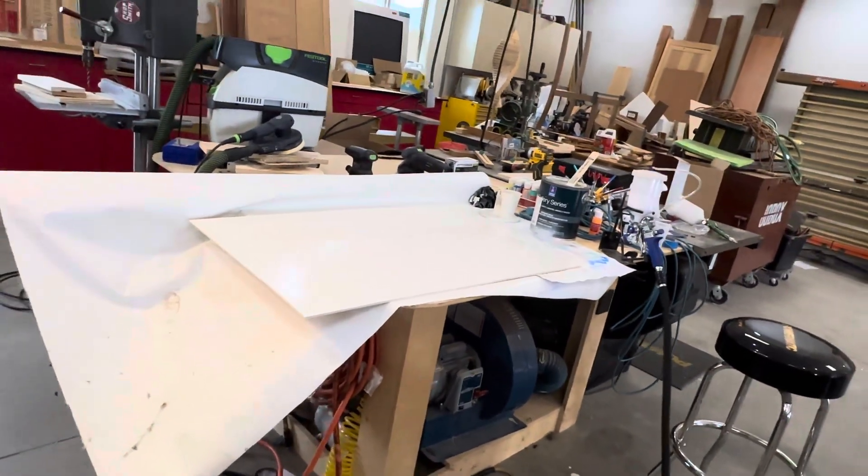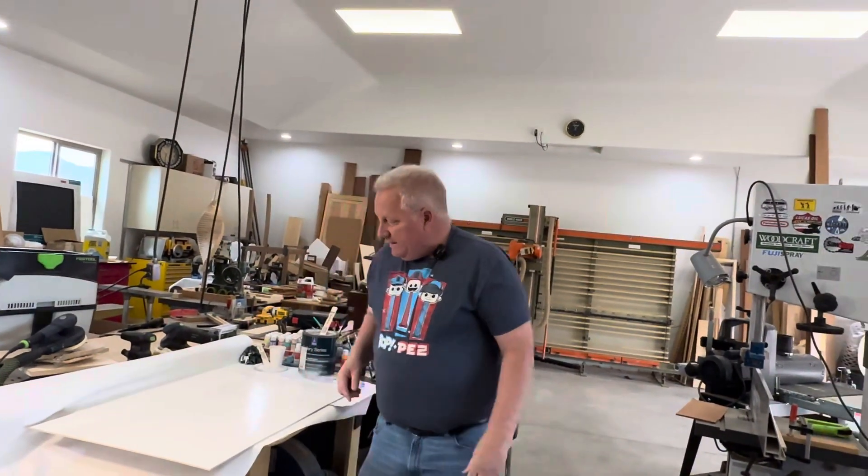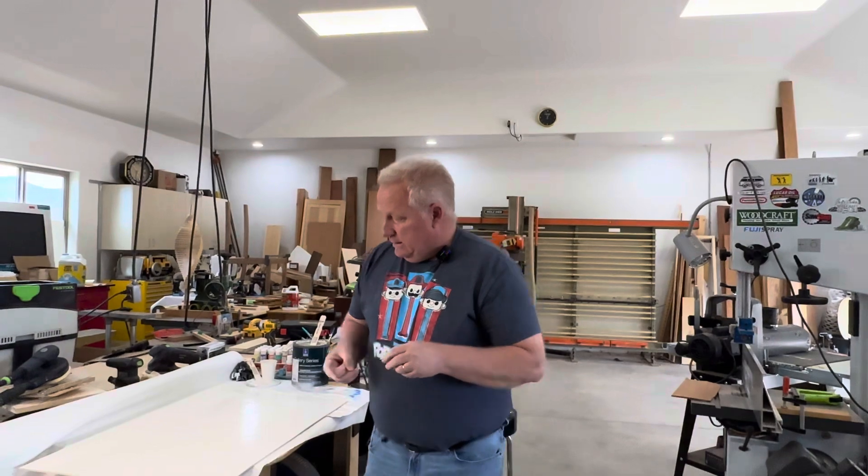I'll probably have to work on adjusting the gun a little bit, but that basically covered the whole thing. I'm going to let that dry and see what it looks like. No primer, straight on the wood, went over it twice. It looks like it's heavy buildup — there's some orange peel in it, but I'm going to have to play with the gun. That was not thinning the paint, straight out of the can, and not really playing with the dial on the HVLP Fuji gun. I'm hoping this turns out to be great. That was my first experience with the paint and first experience with the HVLP Fuji gun. Thank you for watching.